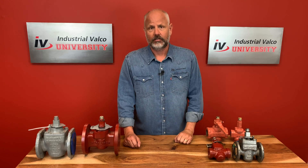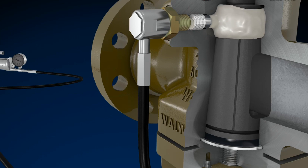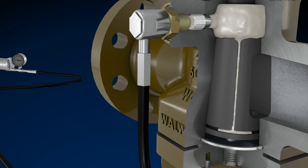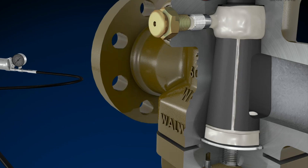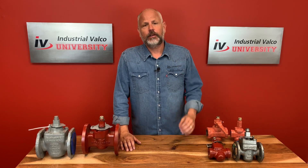The two main types of plug valves used in the industrial world are sleeved and lubricated plug valves. Lubricated plug valves utilize an engineered sealant to lubricate and to aid in sealing. The lubricant in effect becomes a structural part of the valve as it provides a flexible and renewable seat. The sealant is specific to the valve — you can't just buy grease at Home Depot; you have to get it from the manufacturer. It is injected into the cavity, and a check valve below the injection fitting prevents reverse flow. Sleeved plug valves contain an elastomeric body liner or sleeve, typically made from Teflon, installed in the body cavity. The sleeved plug acts like a floating ball valve and presses the plug against the sleeve and body, forming a seal. Like its quarter-turn brothers the ball valve and butterfly valve, the plug valve is not recommended for throttling services.